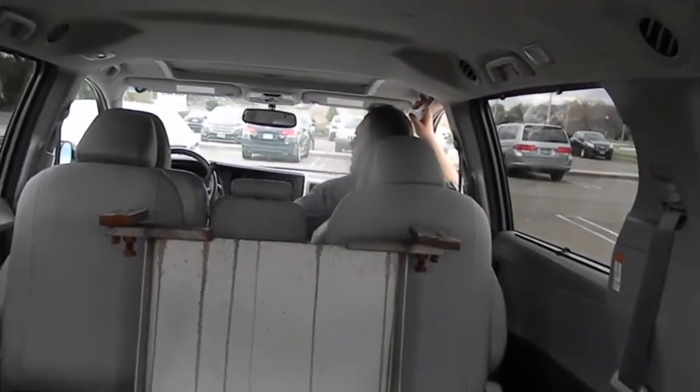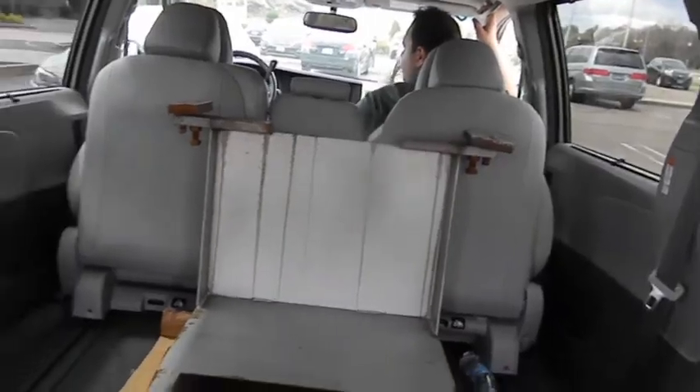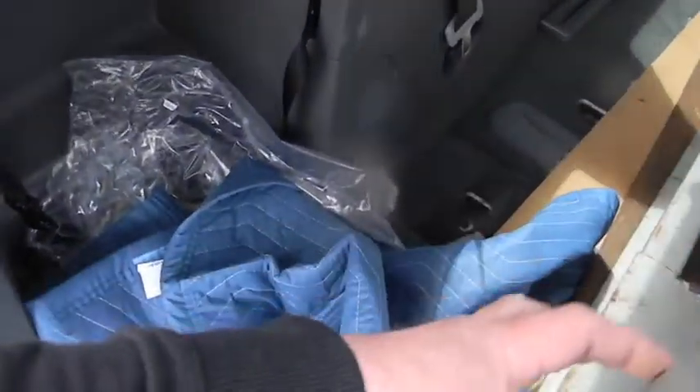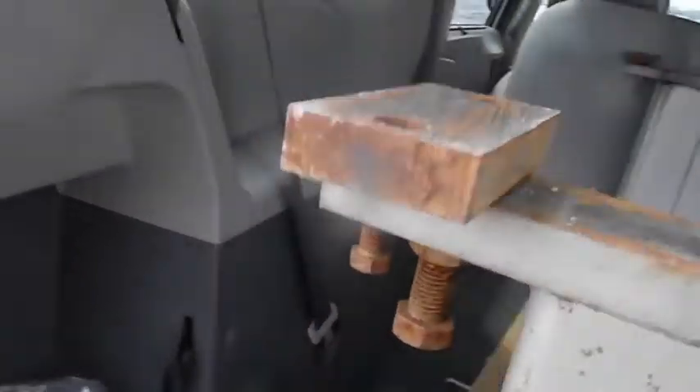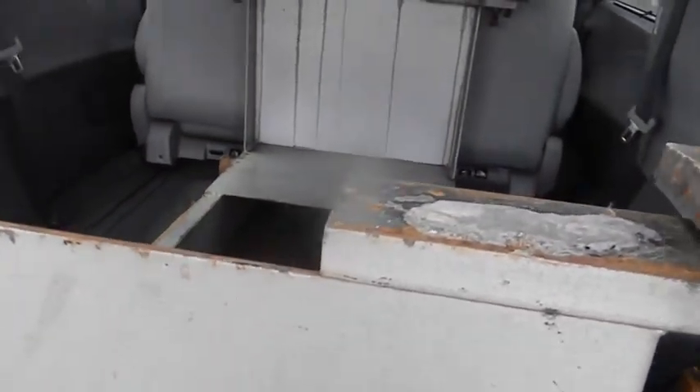Say hello. Thanks Ruben, definitely a nice piece. Made a C-channel quarter-inch plate - this is quarter-inch plate wrapped around like this, one-inch block with levelers. This is drilled and tapped - might add horizontals on there. Here's the top, three-eighths. Yeah, this ain't going nowhere, I can tell you that.